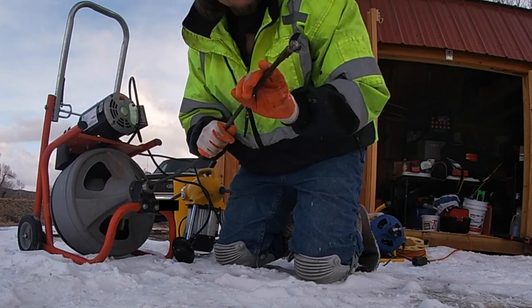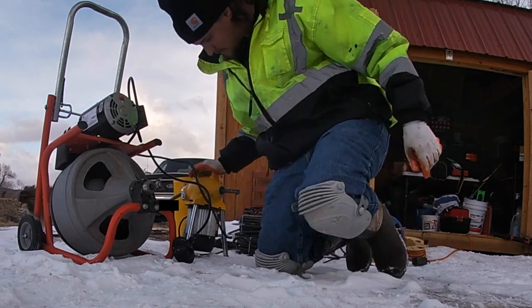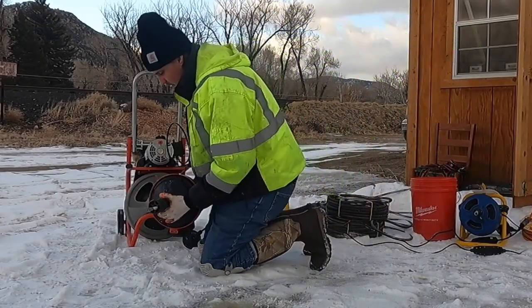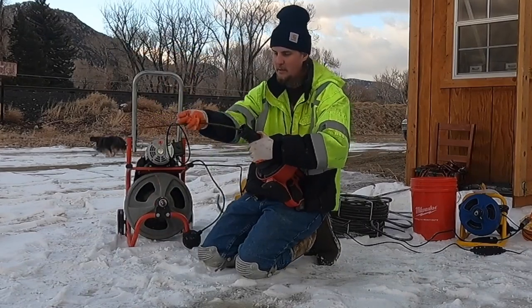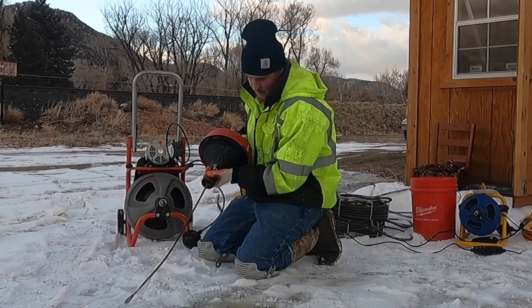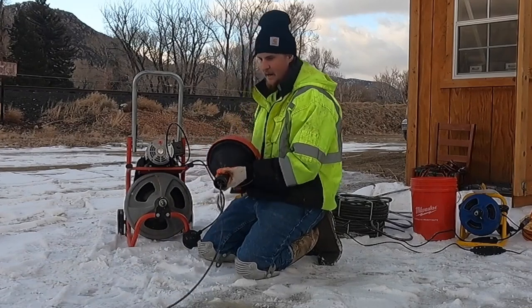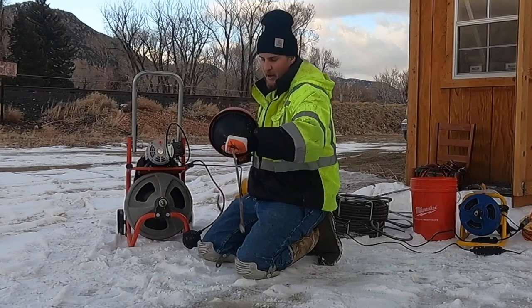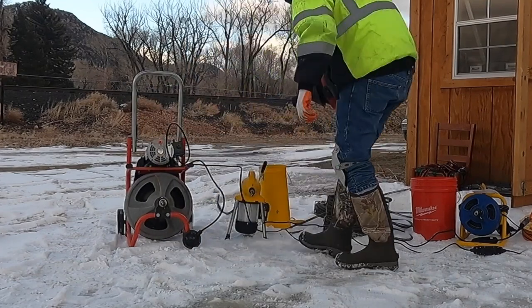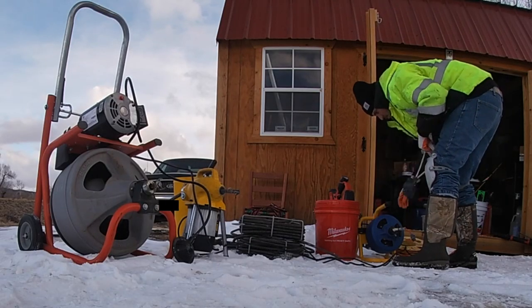While we're on the topic of small machines — you can use this in a kitchen line too, depending on how tight it is. I've used it on local kitchens. If you're careful about cleanup this is fine. This was only about 200 bucks. You just pull your cable out till you get on a bind and you know it's in the pipe, then you pull this back and it grips. You can force it back and forth with it too. I like that it came with a bucket for cleanup — when you're done and the machine is dripping some nasty kitchen gunk, you can just put it in the bucket and call it good.